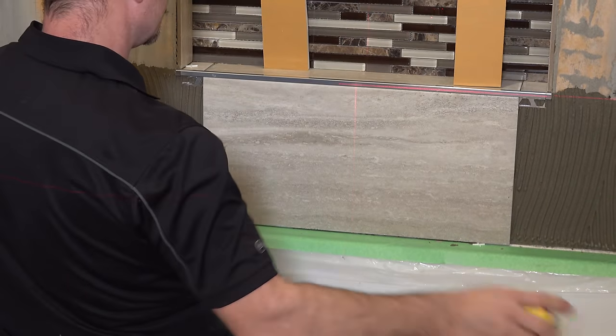With these mosaic tiles, you'll notice I've got little spacers in every one of these grout lines up here. The reason is: when you start stacking tile weight on top, they have a tendency to crush together because they're just sitting in wet mortar with only that mesh on the back, so they want to slide together. You need to put spacers at the points where you're supporting the tile row above so the weight transfers down to where it's solid. Sometimes, depending on how the day has gone, I'll put on my border, then come back the next day to do the upper tiles so it has time to set and I don't have to force spacers in.